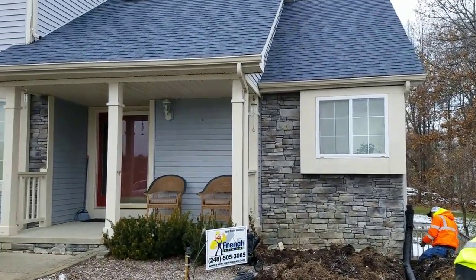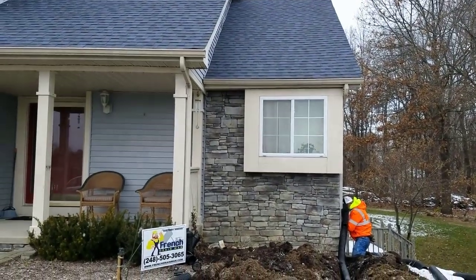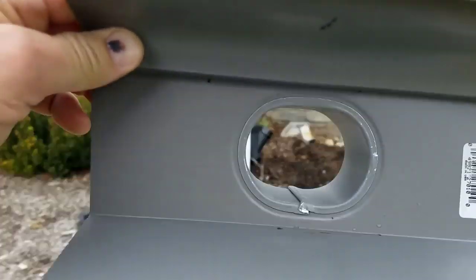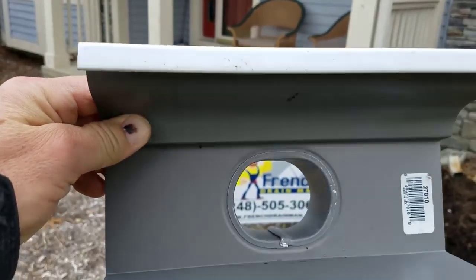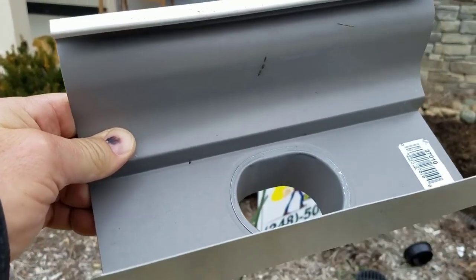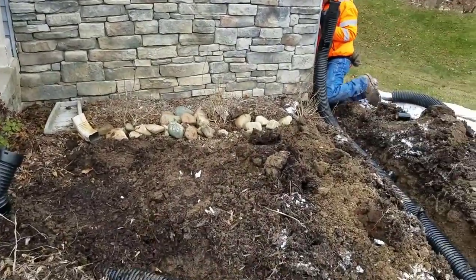One pipe for these two downspouts to take care of two stories of water over in this trough, and then all that flat rooftop — all that sheet water during a hard downpouring rain. So when those gutter troughs are full of water, this is the inside of a gutter trough — that is it. You're asking all that water: when this fills up during an extreme downpour, and they do and they will, this no longer can vent. It's going to be just full of water. This trough is going to be full of water, so we want to move this water as fast as we possibly can.